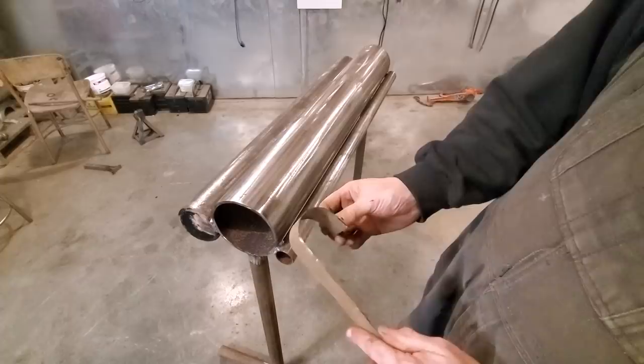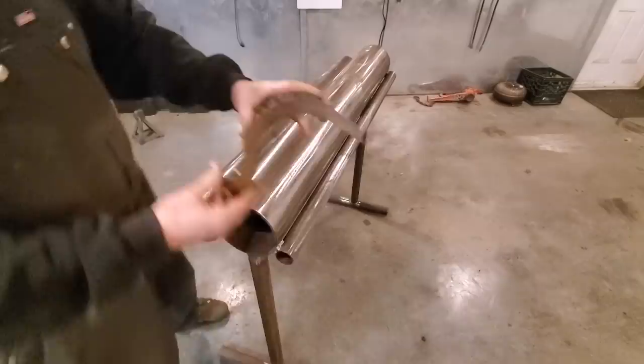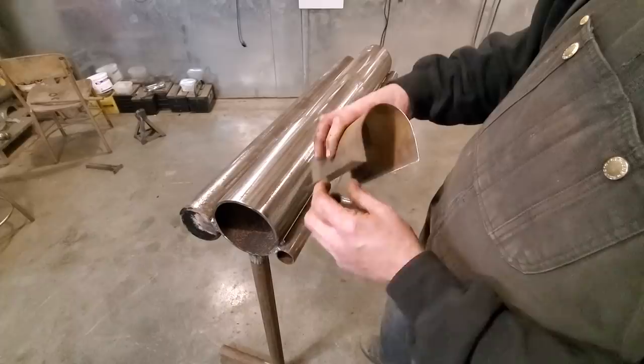You want to get a larger one? Go on the back side. All that there, hold that right around, and you got a large one. Just playing around with it on the small one there, roll it around, give you an idea of a drive shaft tunnel. Here you go, just a quick little playing around with it. You got the nice roll top edge, you put a flange on it. You leave this side a little bit longer, you can bend the flange on it after the fact.